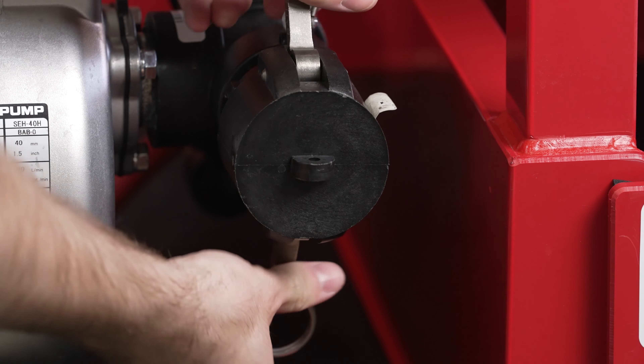You can also order this skid with the Wateraxe Versax 6 configuration, which gives you a Honda GX200 5.5-horsepower engine with recoil start and a low oil sensor. That engine is mated up to the Wateraxe Versax 6 self-priming centrifugal pump, which has a max output of 105 GPM and a max pressure of 120 PSI.